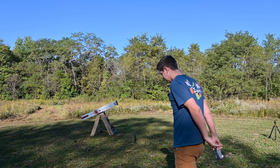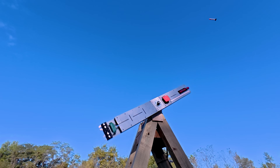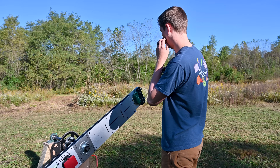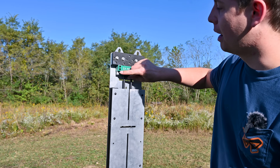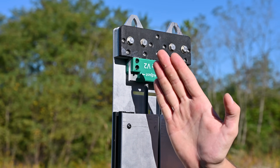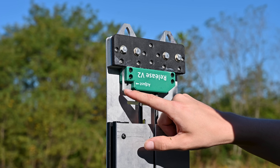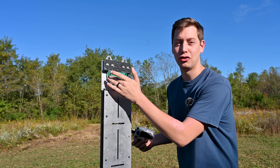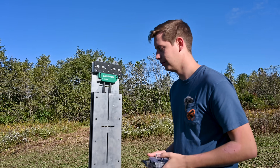That first launch didn't work. I was a little disappointed — I thought maybe I'd just gotten lucky in the garage. But after a closer inspection, I found the problem: I'm an idiot. The adjustable mechanism has graduation marks showing how far the pin is inserted. Before transporting here, the line was even with the green piece, but during transport or setup, this thing shifted. All I gotta do is shift this back and retry — that should fix it.